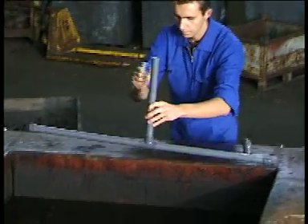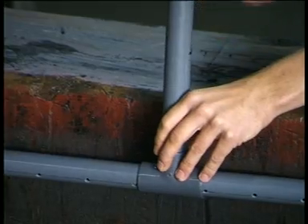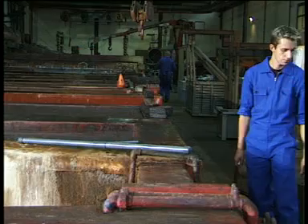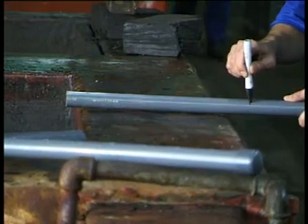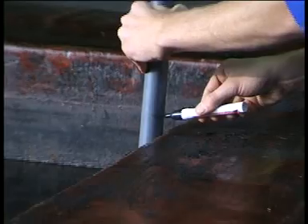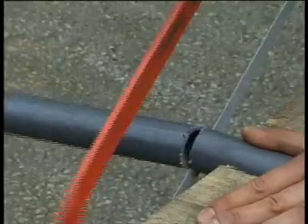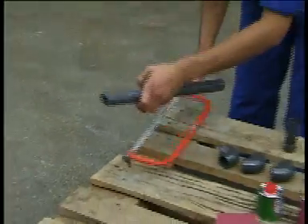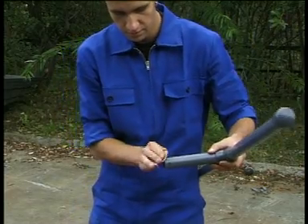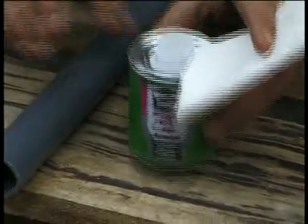The PVC tubing material for the return line has to be cut according to the width of the tank rim and the maximum liquid level. After deburring and cleaning the interfaces, glue has to be applied on both sides in order to fit the single pieces together.